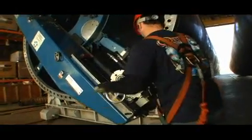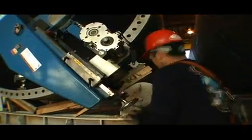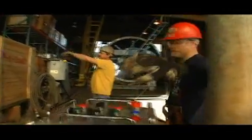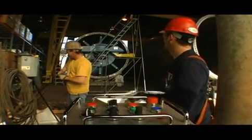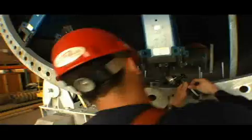The tool that we're using right now is basically the culmination of all of the requested changes and the design ideas that we've come up with and given to Climax. Everything that we've talked to them about is on this new mill, plus some extra things that we didn't expect — speed and power, so it's a more powerful machine. The actual cutting time is reduced because the spindle speed is higher and more horsepower is transferred into the flange.